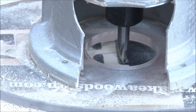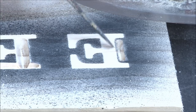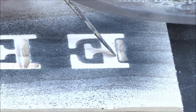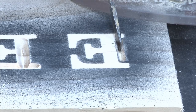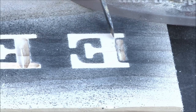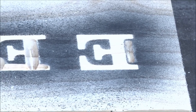I try not to touch metal — carbide — to the cardboard pointer, but I needed something since my fat finger won't fit in there. I look at this edge because this is what really counts. You can see I leave a little bit of a black line there, and then sometimes I'll go back and touch that up if I vary away a little bit. I was talking to somebody not too long ago and they were actually looking at the point of the cutter, and that was causing them to run into the letter and make a bad cut on outset letters.